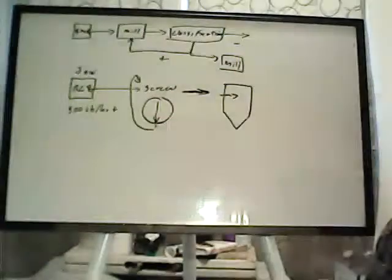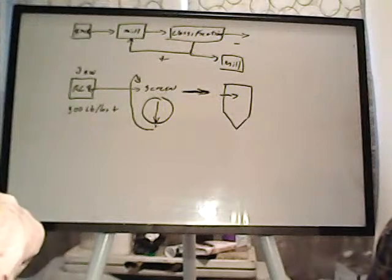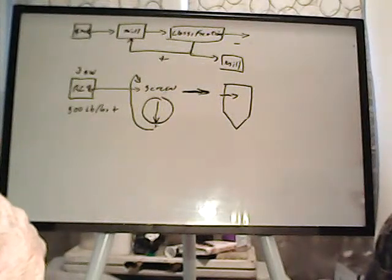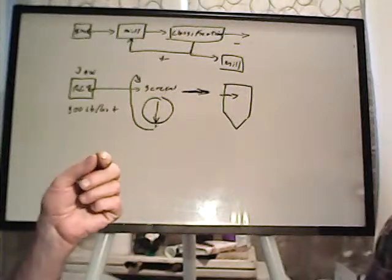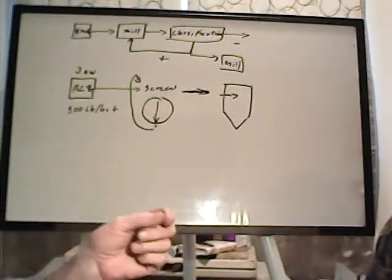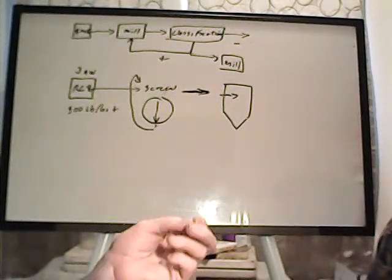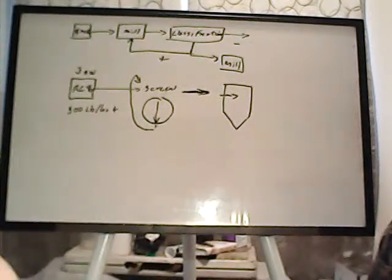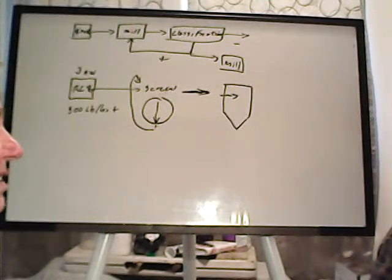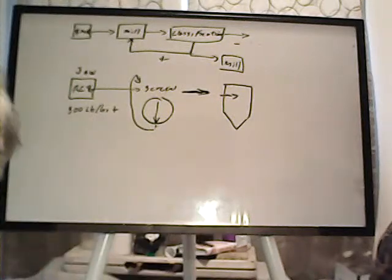So I ordered 50 feet of 18 gauge nichrome, which is basically pretty similar to what we got. According to the vernier caliper, the stuff in there right now is 17 gauge. So with an oxide coating, it may have started out at 18. But anyhow, with 18 gauge nichrome, it should take about 25 to 30 feet spiraled up to make a heating element. And yes, I'll make a video of that too.